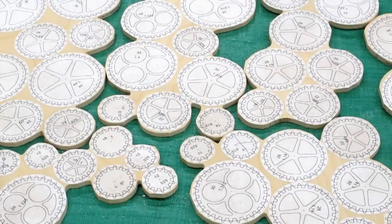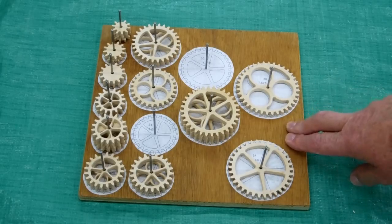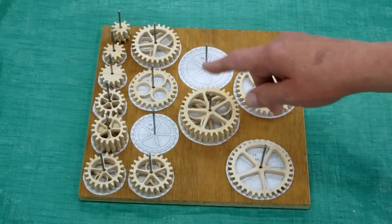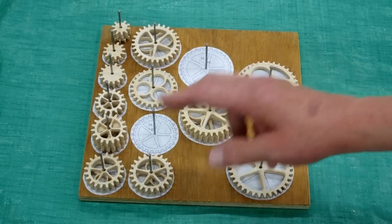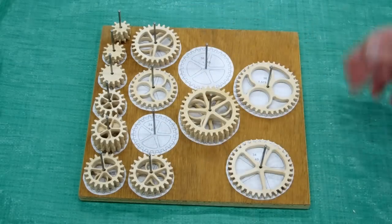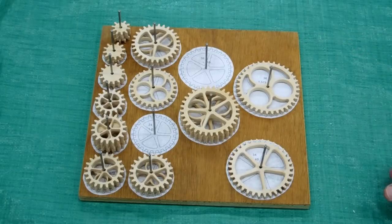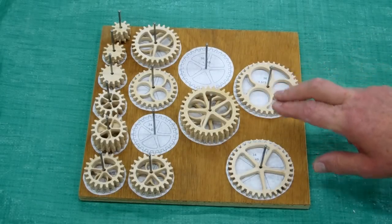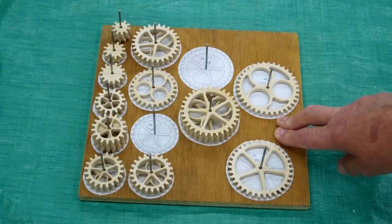Here are a few more patterns which need to be drilled and cut out. If you decide to make a gear head, there's a lot of wheels involved, and these are all in increments of two teeth. It's not real easy to determine one size from another when they're all in a stack, and these have a habit of going missing or getting hidden someplace. Make a wheel board — it only took about 15-20 minutes to make this, and it has saved a lot of time.